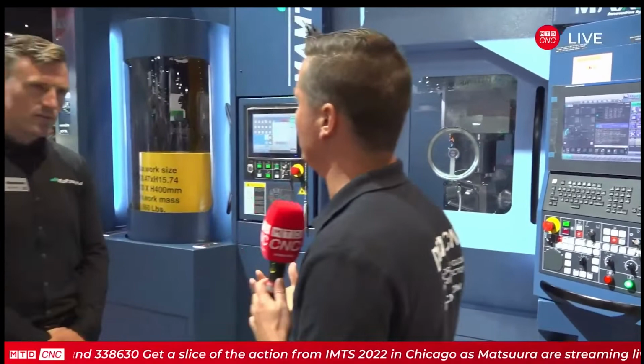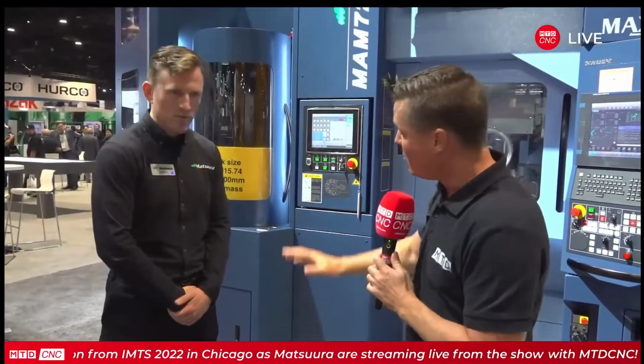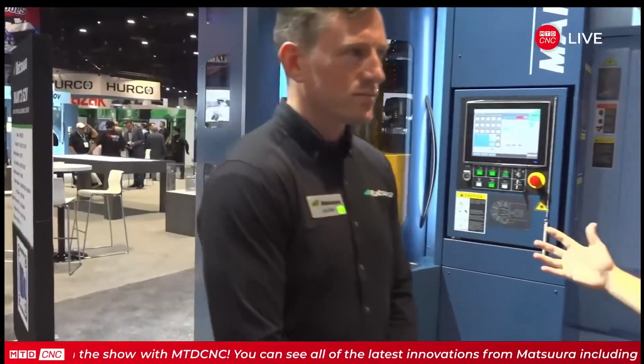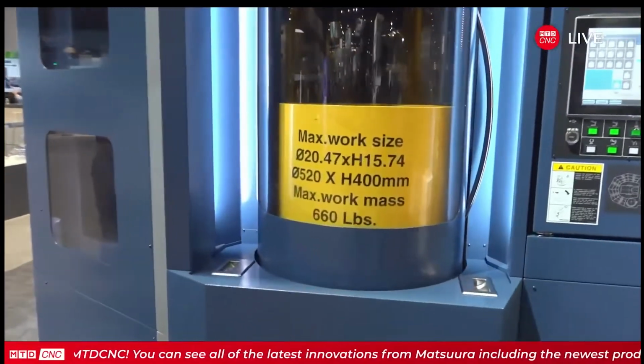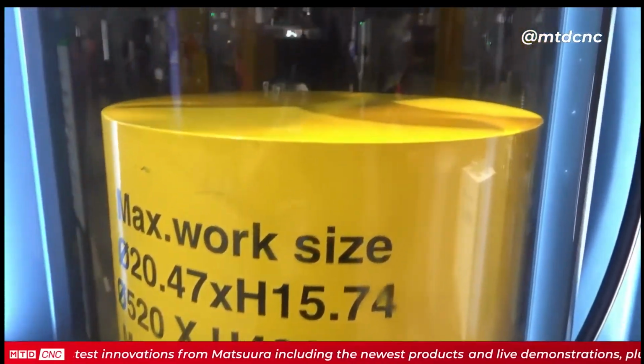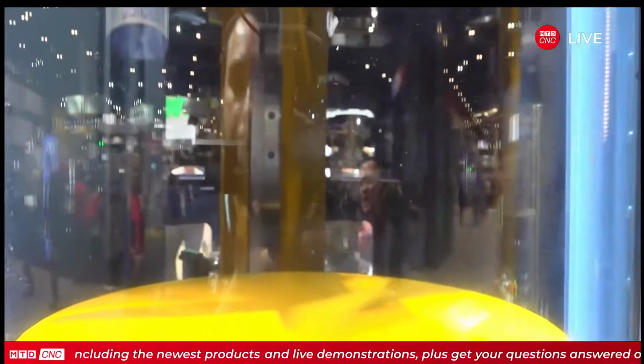And in the industry we're in, we have to be that way. Batch sizes continue to get reduced. Now we're looking at the pallet change here. When we talk about, okay, maybe I have one job, maybe I have 5 jobs, maybe I've maxed out the pallets on here. Regardless, in order to support this many opportunities and low batches, we have to have either redundant tooling or a big tool holder. So let's talk a little bit about that aspect of the machine.